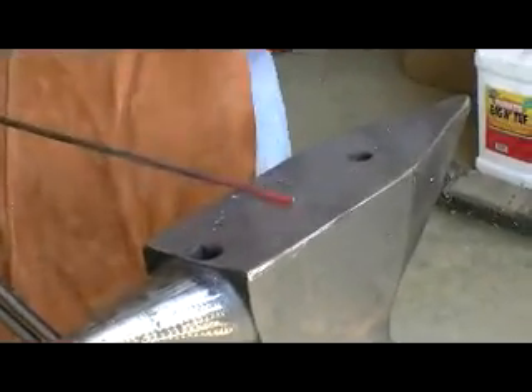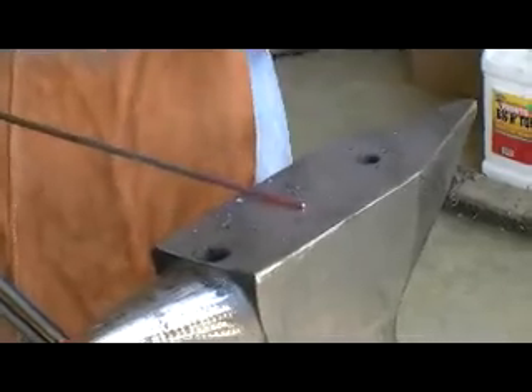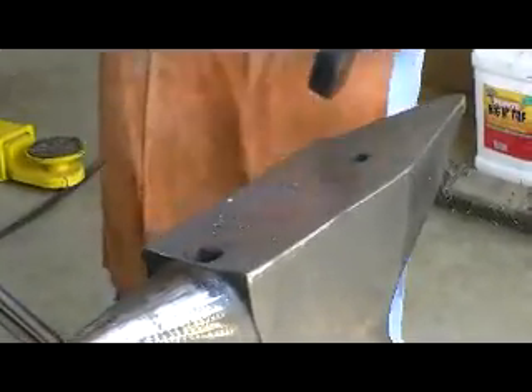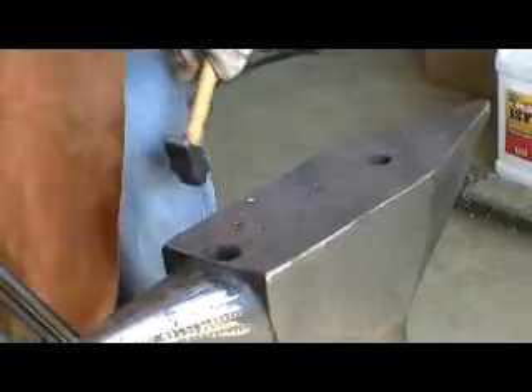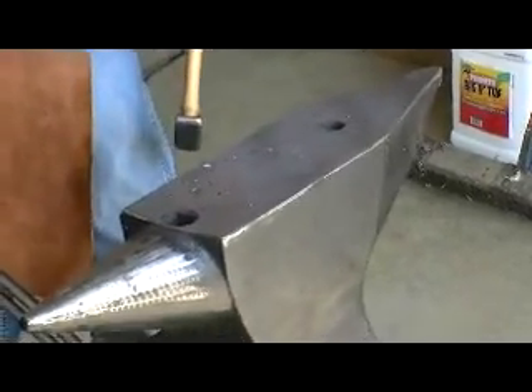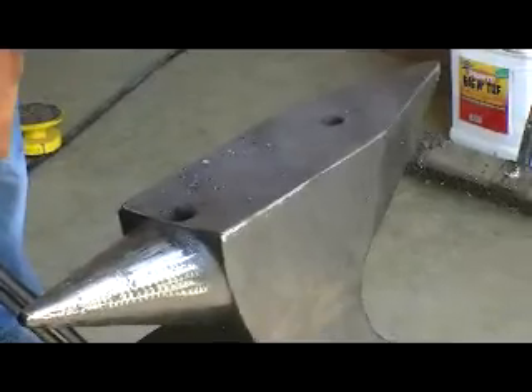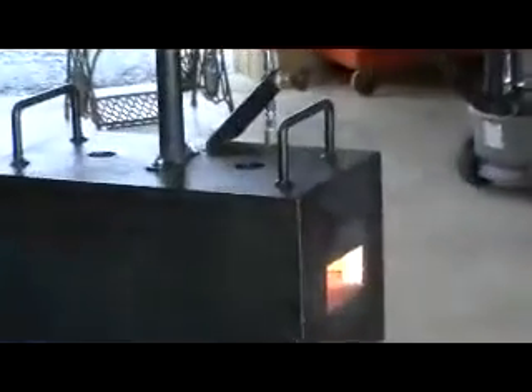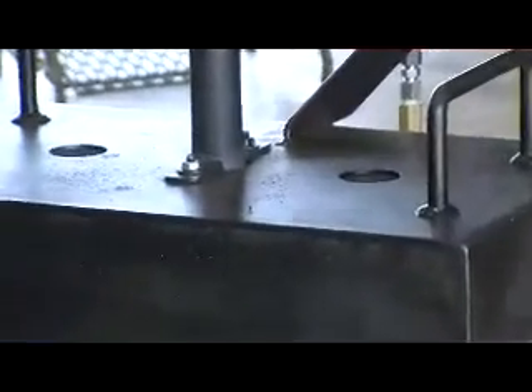Excellent beginning class. We just recently accumulated the tooling for this — it's just a lot of fun. We haven't developed any real skills yet, but we're accumulating the parts necessary to make the pieces. A little bit later I'll be offering plans for a simplified propane forge, same basic size and dimensions. You'll notice the forge is designed for up to three burners — there are three openings at the top — and it's just a matter of adding those if you need additional heat.